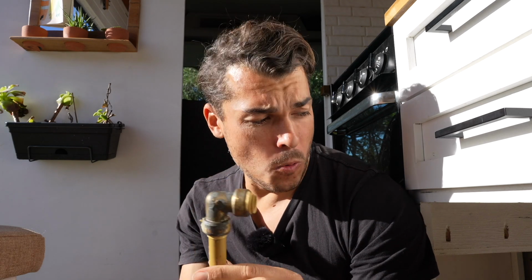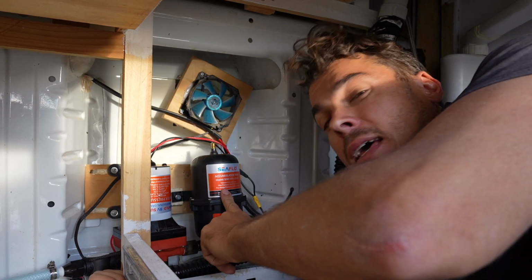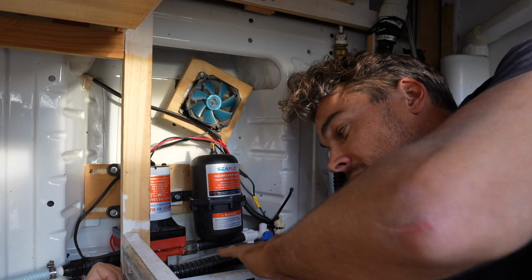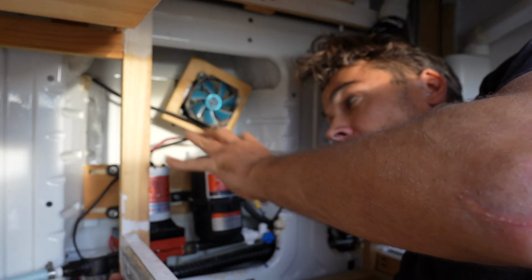If I would have built this van with another PEX system where I had to crimp it or use another joining method and I wanted to update my water system, it definitely wouldn't have been this easy, and I would have had to cut a lot of hoses and rejoin with a lot of new connections. Okay, so I've got the pump and accumulator installed inline. I had to cut a couple of the water pipes to rearrange everything, but it all fits in there nice and snugly.